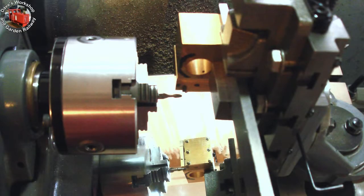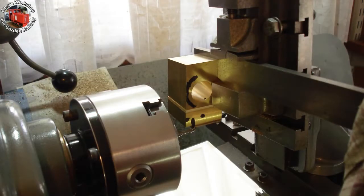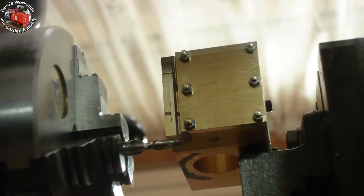The left cylinder is first up, mounted upside down on a piece of one inch by a quarter inch steel flat — it was the only way I could grip the odd shape. It's screwed to the flat like the cylinder is screwed to the loco frames. I'm checking the progress of the cut using my workshop mirror.